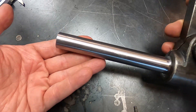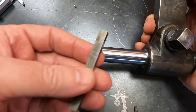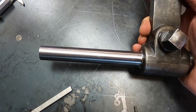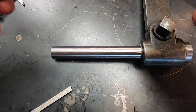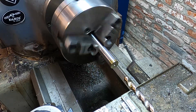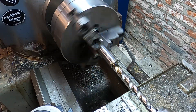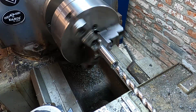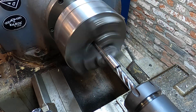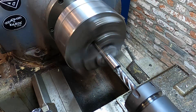Here's our mock-up tool holder and the bar as it sits. This is our tool blank — a piece of M42 high-speed steel, quarter-inch. It's going to go right down here, and the way we're going to make that happen is courtesy of our friends at Dumont: a quarter-inch square broach. I've decided to make the tool holder portion replaceable so I could have a variety of sizes, not just quarter-inch square. We're going to counter-bore a half-inch counter-bore and then drill and tap for a 3/8x24 thread on the ID at the bottom of that counter-bore, which will be used to hold the tool attachment to the bar.